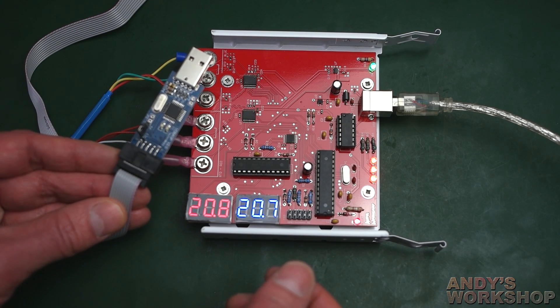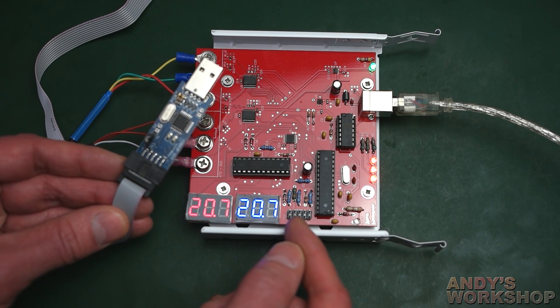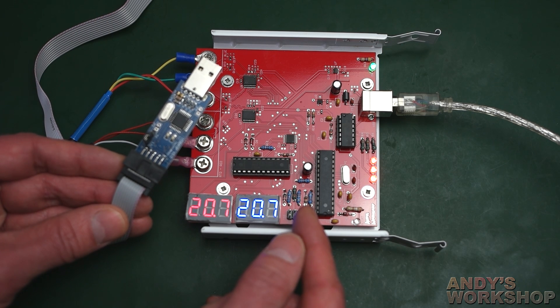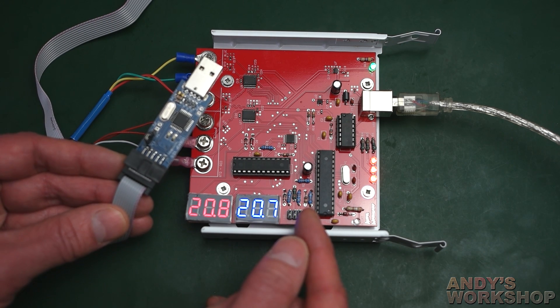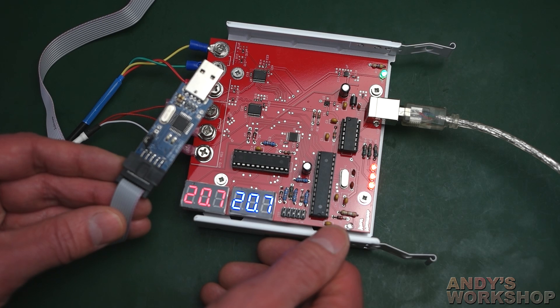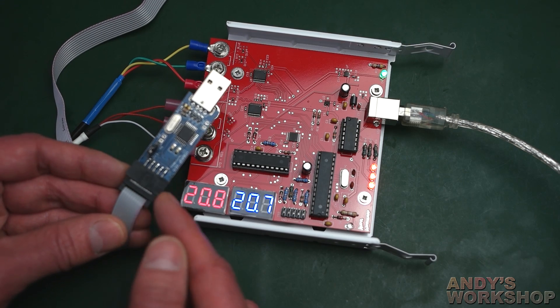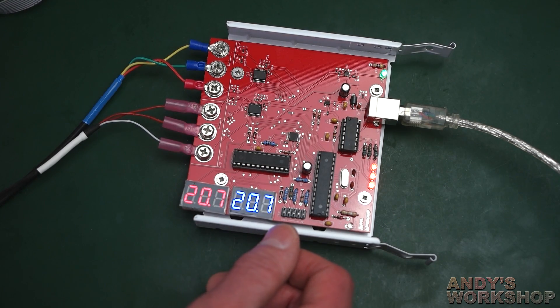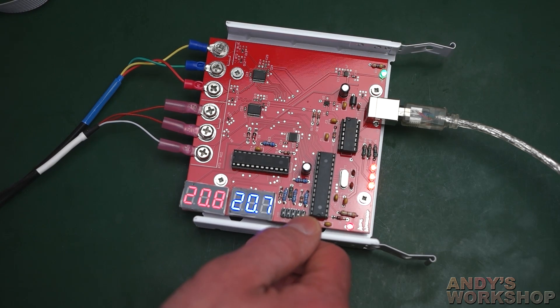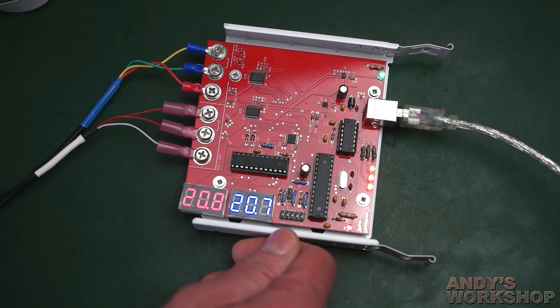In this implementation of my ISP interface I've used Zener diodes to cap the input voltage levels to 3.3V rather than 5V — on MOSI, MISO, the serial clock, and the reset line on the USB ASP. You can see it in the schematic on my website. I checked it all out with a scope and breadboarded it before putting it onto an implementation like this. The levels are successfully capped, and at the low speed of the ISP interface it's not a problem.